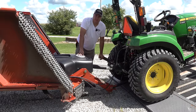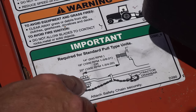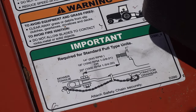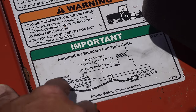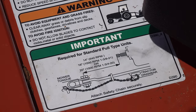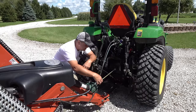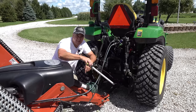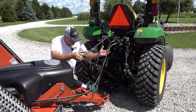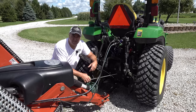Remember what I said about the stickers and the book? Take a look at this. The first thing it says is 'Important' — which apparently means ignore it, to me. It says required for standard pull-type units: you need 14 inches from the center of the hitch pin to the tip of the tractor's PTO shaft for the 540 RPM version. For the 1,000 RPM small shaft, you need 16 inches. For the 1,000 RPM large shaft, you need 20 inches. But 14 inches for my configuration. On the day of the incident, I was set in the third hole — that squeezed things together, pushed the PTO shaft inward, destroyed the housing and a lot of the internal components.